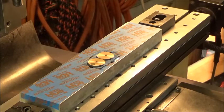We're going to use a 1/16 of an inch end mill. We're going to try to cut these out with two different cuts. We're going to attempt to cut the holes first, then cut out the perimeter. The little 3/4 inch pieces are large enough that I can just eyeball the end mill in the center of them. That'll be the starting point for both cuts. So let's get started. I'm going to set up a cutter in the mill, get it zeroed in, and get the CAM-BAM file loaded, and we're going to attempt to make this cut.